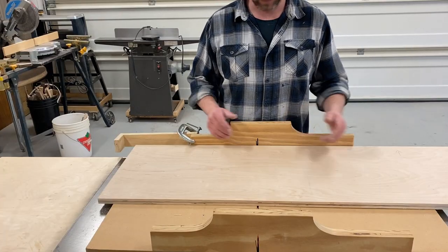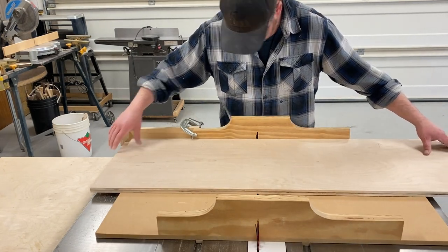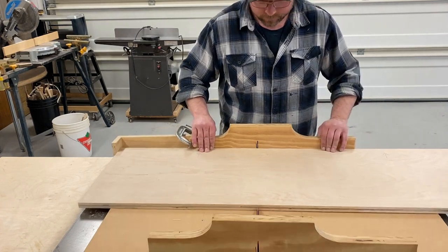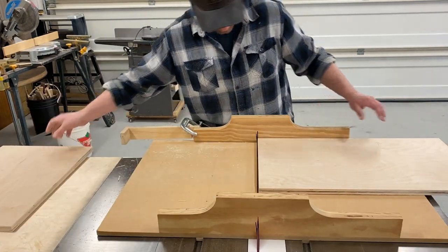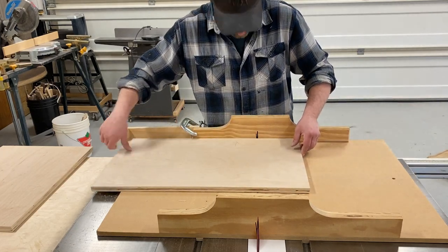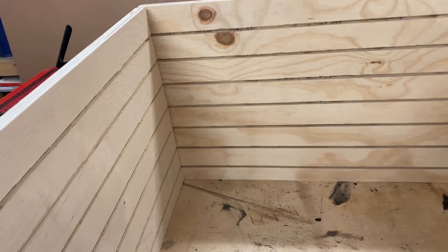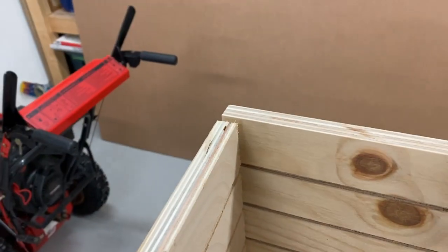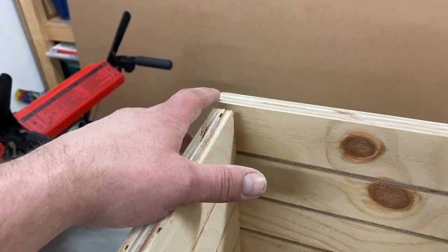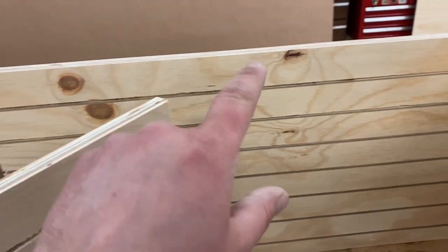I set up to 20 and a half for our lengths, made two cuts with a stop block to make sure both are exactly the same. Now we have two sides and the back, and the lines match up perfectly because we cut them all at the same time. Next we're going to cut a groove in there for a tighter connection — I really don't like butt joints. Then nail and glue it together, put the top on, and start popping out all these shelves.